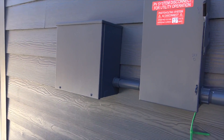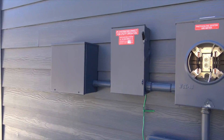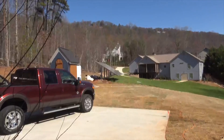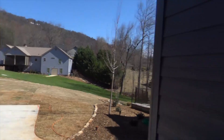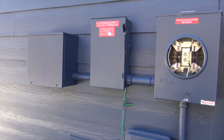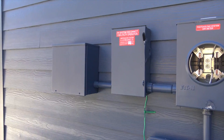The other thing is called a remotely operated circuit breaker — ROCB. This system is a little bit of a mad science because there are a lot of controls. We're using the ROCB breaker to turn off the inverter as well. For the most part, that inverter is going to take every bit of power and send it back to Duke Energy, but in grid-down situations or when the generator is running, we have to make sure we don't back-feed on the generator or overcharge the batteries.